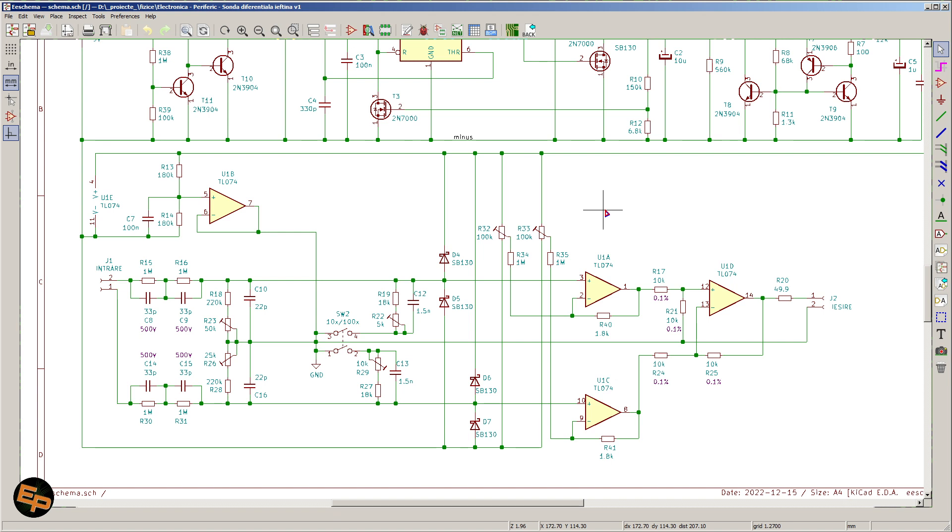So that even if something happens and the voltage goes a bit lower — like 25 or 24 volts — these op-amps will still work well. Now, let's move on to the next problem I had when designing this. We need a ground and relative to that ground we need to have both positive and negative voltages, because the entire concept of this differential probe is to basically have a dual voltage divider on the input relative to a ground. Then we would get two different signals that would enter two different buffers of what's called an instrumentation amplifier.